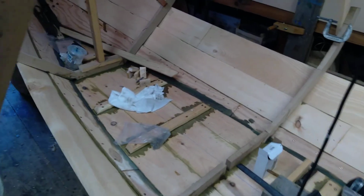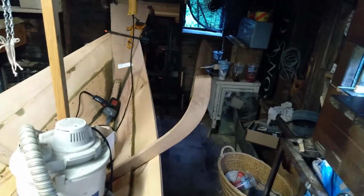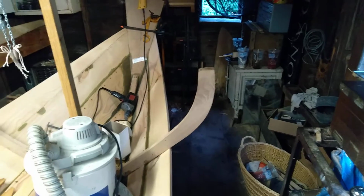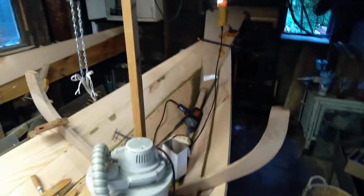And you've got to remember that this design predates planing hulls, and the idea of planing hull technology, which is a straight run aft, but also keeping the transom wide. That width actually is displacement that keeps the boat more level, keeps the bow from rising, keeps the stern from sinking. But the other aspect to planing hulls is that straight run, and that's what these old dories have. They have a very straight run of planking aft. These old racing dories anyway; the working dories got a lot more shape aft.